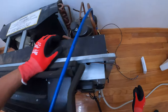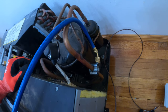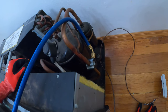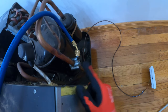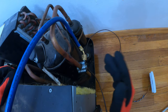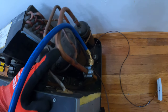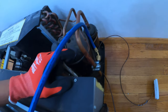This is a self-contained system. And here we have a piercing valve installed, as these don't come with any ports to access the refrigerant. I actually did make a video on how to install these, so you should definitely check that out. I'll also be leaving a link in the description, and you will see a pop-up at any moment on how to actually install this. So right now, we only have the low side connected to the system, and that's the side you're gonna wanna charge the refrigerant with.